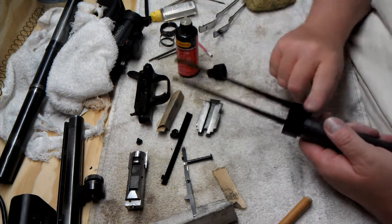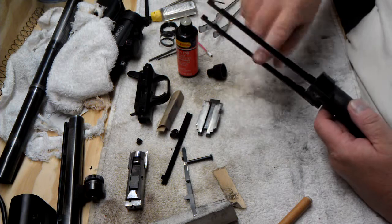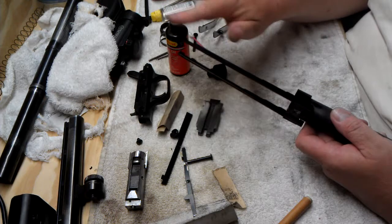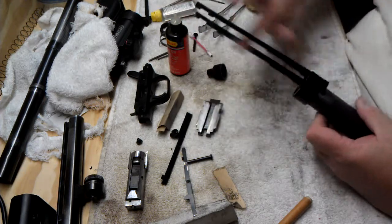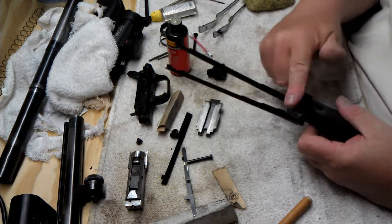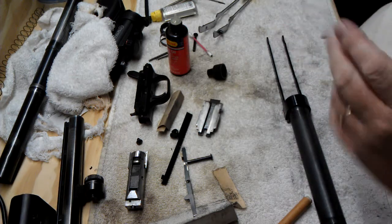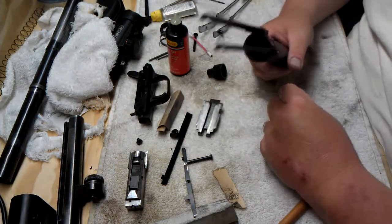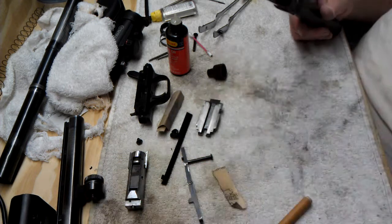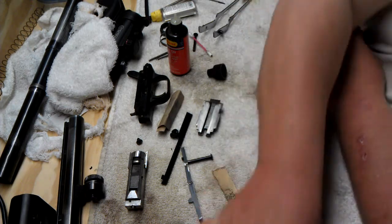My very first blue job — I was getting anxious, I wanted to see it done. It was an old .22, and while in the end it came out beautifully, I had to redo everything because it rusted. Normally I'll leave these sit with the oil on them for a day or so. Since I'm probably not going to take this to the range for a couple of days it should be fine. It's not perfect, it doesn't need to be — but it is what it is. I'm going to touch up a couple of spots on the barrel too, just because I'm not Dura-coating it yet. I haven't really decided on the final finish, so until I get around to that I'm just going to leave it blued.